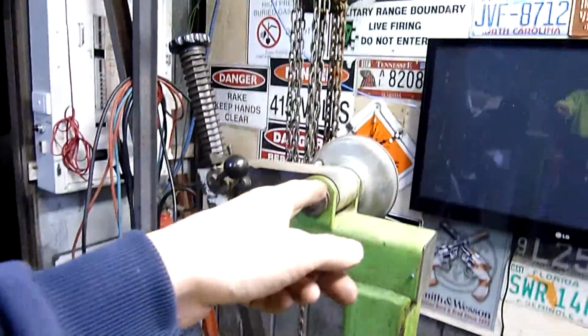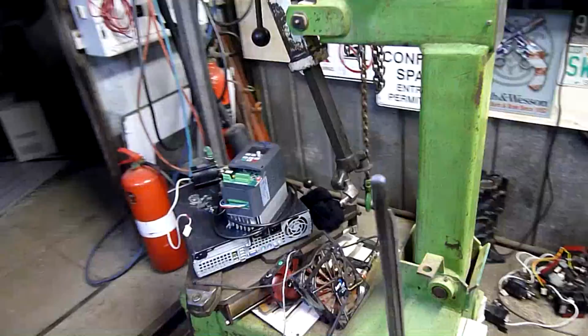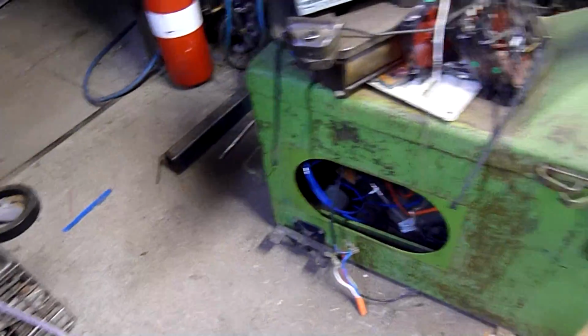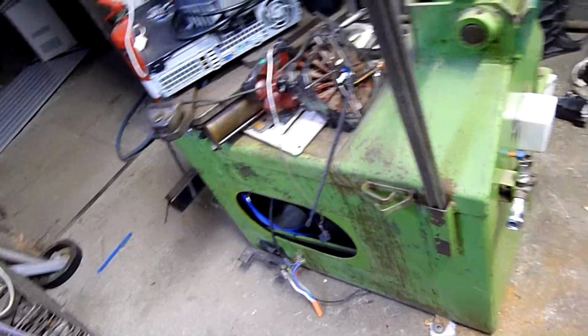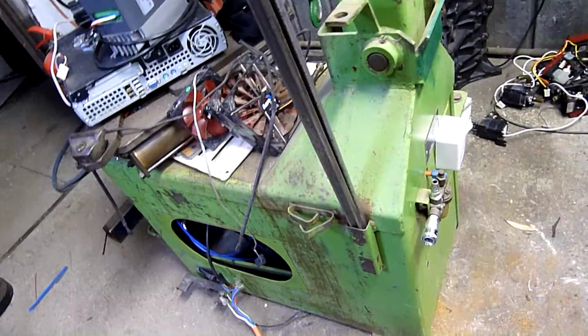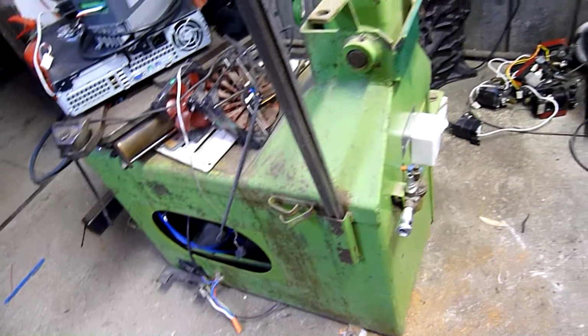That leaks most when it's clamped, which is avoidable. You just clamp it when you're ready to take the bead off and then unclamp it. But yeah, it'd be nice just to have a shut off, so I can shut it off, pull the airline off without dumping the system pressure in one big noisy blast. Particularly being a residential carport, you don't want a massive blast of compressed air every time I unplug it.